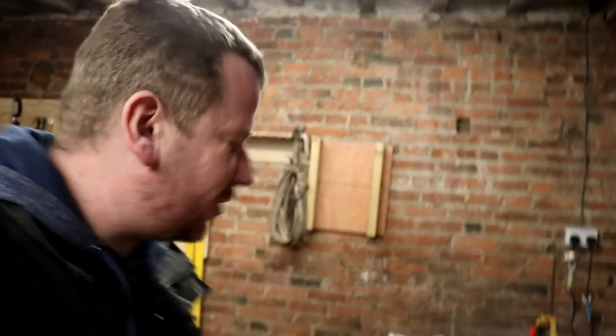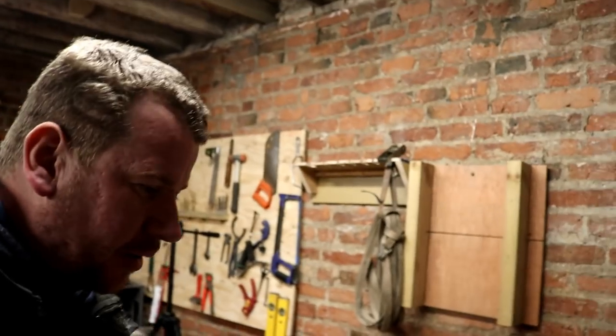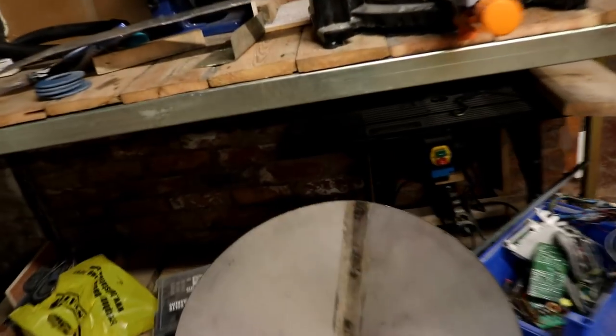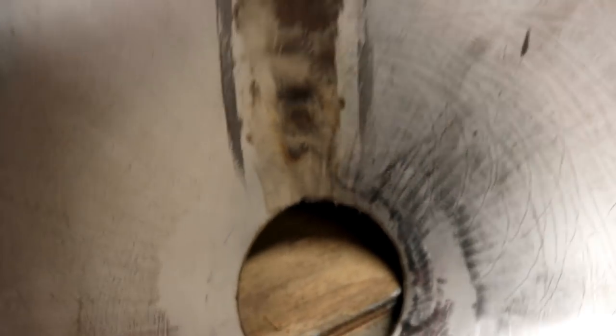It's beginning to get dark outside - gone five o'clock. This is the second flat cone and actually I've picked up the pace. There has been one blowout, one hole - I'll show you. We had one hole there. I'm not going to touch it, it's still hot. All the rest of that seam ran pretty nicely. I also got a grinding wheel out on this one and a flapper disc, and that's what we've come up with. So it's not perfect, but I've got a polishing wheel and I think we can sort that out. And if I flip it over you can see she's not too shabby - I mean, I wouldn't want to sell it, but it's functional.